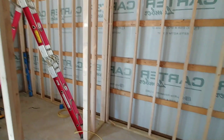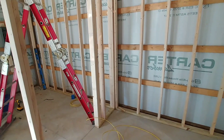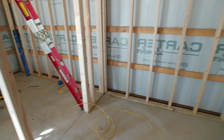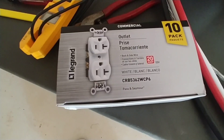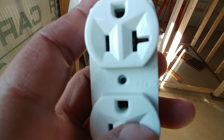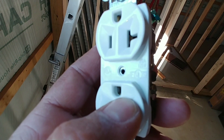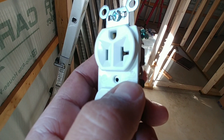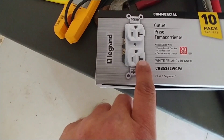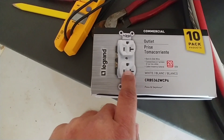Back to the main point — installing branch circuits. If you want to do 15-amp circuits, feel free. The biggest thing to remember is if you're going to do a 15-amp circuit, you've got to have a 15-amp breaker, and then you would use 14-2 wire. The other thing to keep in mind is the outlets themselves. If you're going to do 20-amp branch circuits, you've got to have outlets that have a 20-amp designation — you'll see it says 20 amps and 125 volts right on the outlet. Another giveaway for a 20-amp outlet is the little piece sticking off the side for your neutral. If it was a 15-amp, it would just have two straight blades.